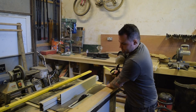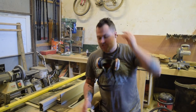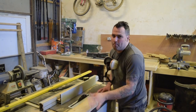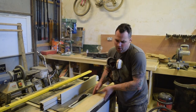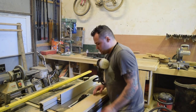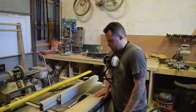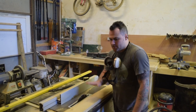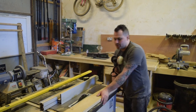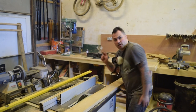Okay, so now I've got this down to 130mm. The finished size is 95mm. This is a lot better to work with — we've got a couple of relatively straight edges. What I'm going to do now is rip it down to about 100mm, which gives us 2.5mm either side to play with. So we're going to take it down to 100mm and then we'll plane it up. It'll be a lot easier on the machine and a lot easier on the blades.